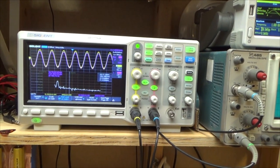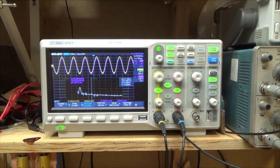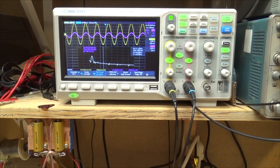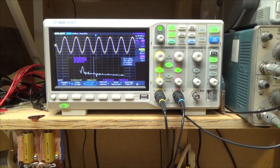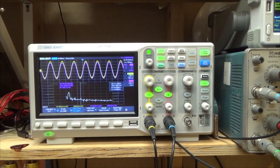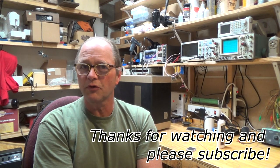It looks like it was a tube issue — I had all kinds of microphonics before and now the waveforms look really good. The other one shows a little distortion so I'm going to change out both tubes. After swapping the tubes it sounds pretty good — the amplifier is working great. I'm going to cut it off right here. In Part 2 I'm going to work on the speakers since the tweeters aren't putting out much, put banana plugs on it, fix the case a bit, and more. Thanks for watching — please subscribe if you haven't yet and stay tuned for Part 2.